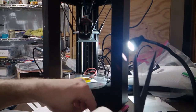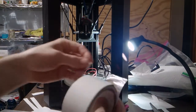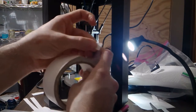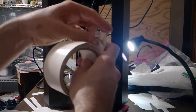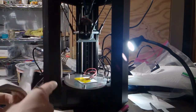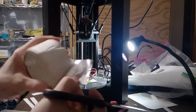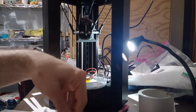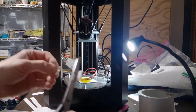Well, you know what? I can go ahead and line up an index card how I want it to be lined up on this tape. Of course, HVAC tape's going to have some amount of thickness associated with it, but by the time it's compressed, it doesn't amount for a whole lot. Alright, so now I can cut that tape. Let's cut that guy.